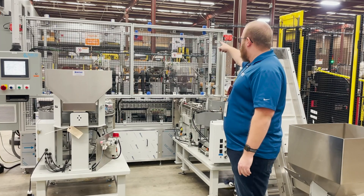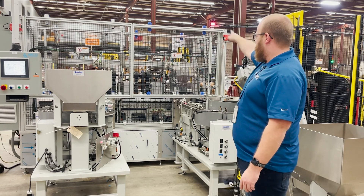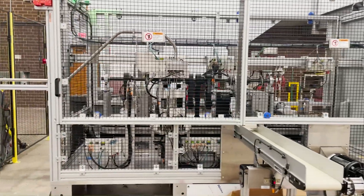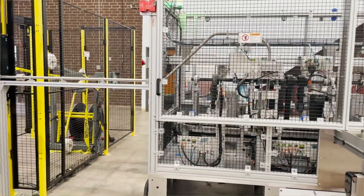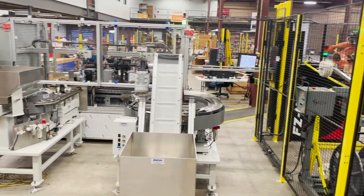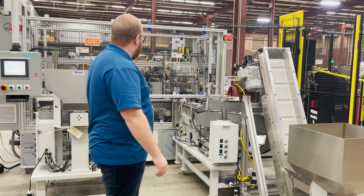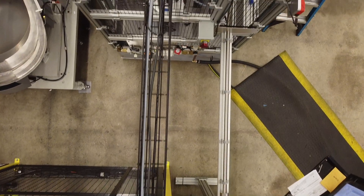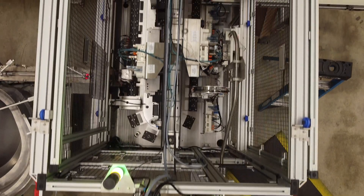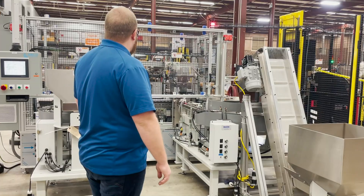When we come around to the back side of the chassis — this is a carousel chassis so it makes its way around to the back — we utilize a Fentorin SC11 spring coiler for the third part, the spring. We vacuum assist the springs over from the spring coiler into an escapement that singulates them out for a third VIP pick and place to pick those and place those on the pallet. That is our third step in the process.